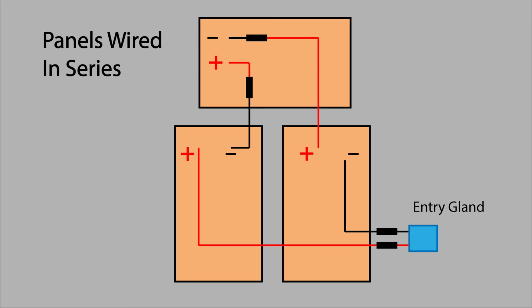It runs at a higher voltage, so you'll always have a minimum voltage even if your panels aren't running at peak efficiency, as in getting the most sunlight possible. You can run at a certain percentage of sunlight on them and attain the charging capabilities as long as you have an MPPT controller. So in this setup, you'll run at higher voltage but lower amps, so you'll still attain that 14.4 volts through your controller. For these particular batteries, the lithium, you want a little bit higher voltage, so that's why I ran these in series.